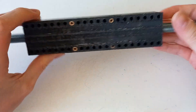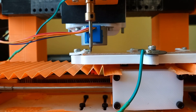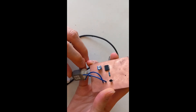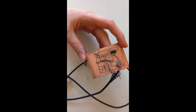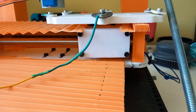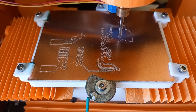The M8 rods are also used to join the pieces. The machine can get pretty fine traces thanks to a four-plane approximation of the bed. It is suitable for many SMD components and it can also drill holes, making it good for THD. One notable thing is that homing is pretty accurate. Here you can see me milling the same pad twice after homing and once it's done you can't even notice it.